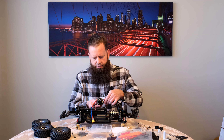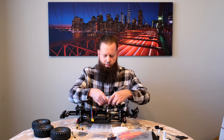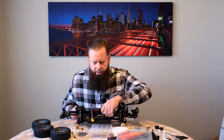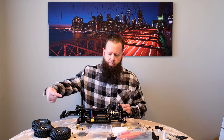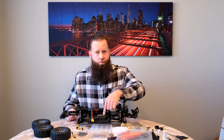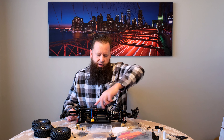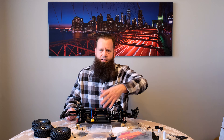I've got the ESC out here. I was trying to mock up what position exactly it's going to go for the smoothest cable routing — both to the motor, but also to the receiver box, which is on the other side. This servo wire really isn't long enough to go past the receiver box and then come back in the other side. So I'm probably just going to take this little rubber plug out of the receiver box and run it through there and leave it in that orientation. Otherwise I can flip it around and come in this side — that's a possibility. But there's a little bump out on the one side and the body might not fit exactly right.